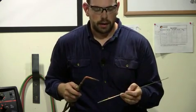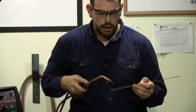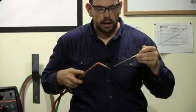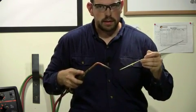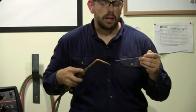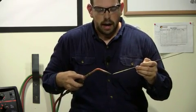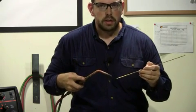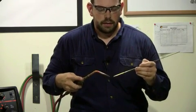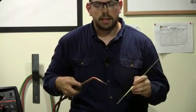What you do is you heat the metal up and you dip the rod. This is probably the most — or rather the least advanced welding process, but I will say it is probably the hardest to learn, because it's very difficult to control the torch and dip the welding rod at the same time.